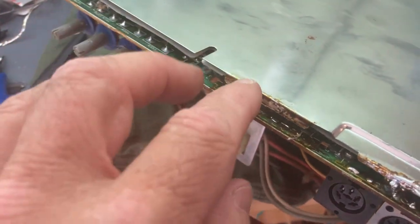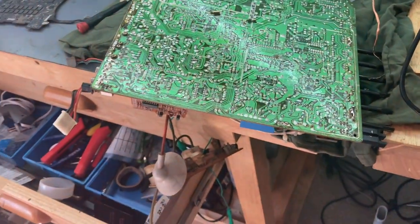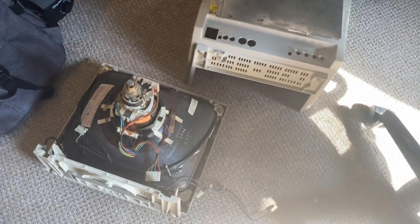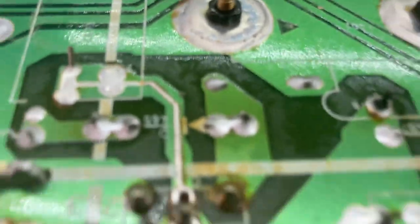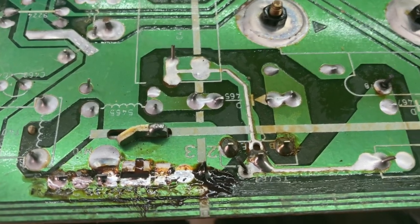This always takes a little while with these monitors. They really pile on the solder for the shielding, so we need to get all that solder off so we can pop the shield. This one actually has more solder than the last one — solder here, here, here, here, all around this side and even on the back side. Here's the flyback transformer and we'll look around in here. Hopefully find something obvious, and we found it already — two seconds in, minus the hour of removing the shield.